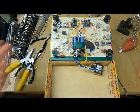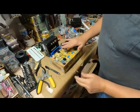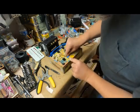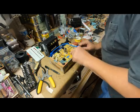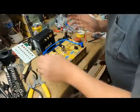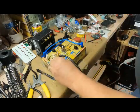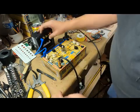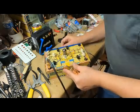So now I'm going to dare to try putting in a 12AX7 and seeing what happens. I've got my 12AX7 in. Let's see, let's pick something kind of mundane there. Alright, filter caps are off except for I've got one there. That's the input to the first gain stage, and we'll try that first. If it doesn't catch on fire and kill me, it makes me stronger. Heater.